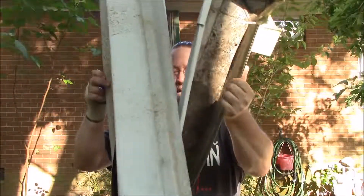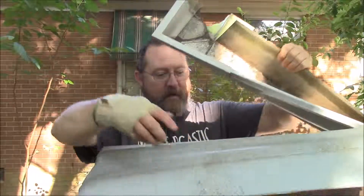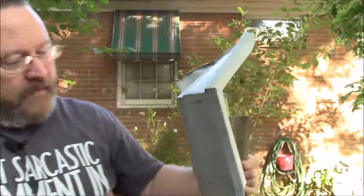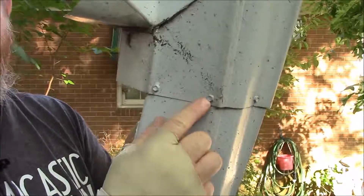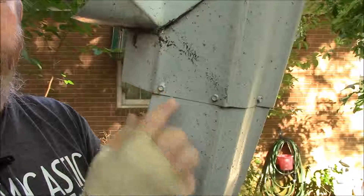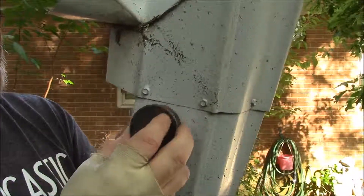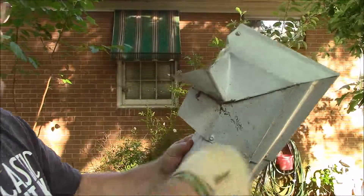I'm just going to show you a couple of really quick ones here. On this gutter piece, as you can see, all of this is aluminum. But on this side here, if you can see them — yes, these are screws. And this is a screw here, and of course they stick to the magnet. My magnet is a little bit heavier, but you can tell that they stick, but they won't stick here on the aluminum. So I just wanted to show you that you have to take this stuff off. This is usually around the turns — I guess you would say the corners.